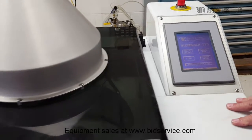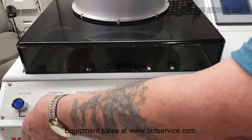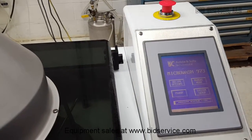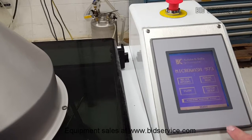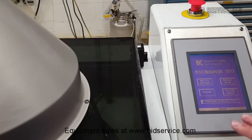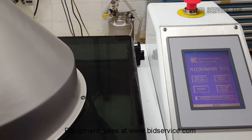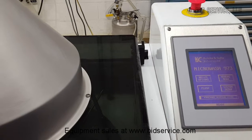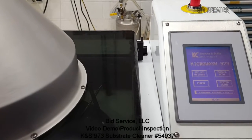I'm going to shut the power off. Just so you can see, the power comes on very simply — starts up, goes through a startup screen, and then comes to the main page. There have been times when we get an error: instead of coming to ready, it'll say 2905 communications error. This is a very well-known bug in their firmware — it occurs randomly and very seldomly. You just have to shut off and turn it back on again, and it mostly goes away. It happens once or twice and that's it — it's nothing wrong, just something inherent in the system.